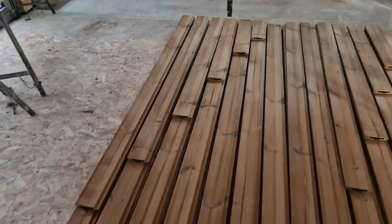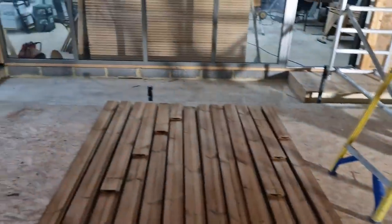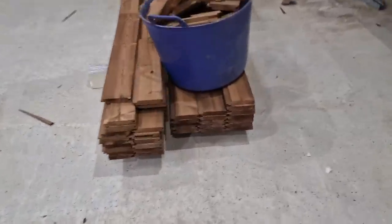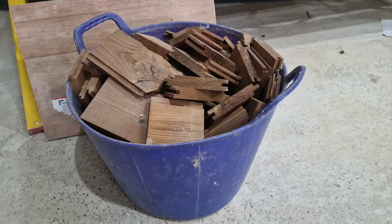I'll talk about the joints. Because we're using this Lamello, we're not creating any waste. The waste is very, very minimal. We're just trimming the ends up square and then using the cladding. We don't have to get a tape measure out once because we have the bench all set up. The bench enables us to literally just get the cladding from the pile, the ever diminishing pile, I might add, it's much, much smaller now, it's tiny. It goes from the pile onto the saw, cut the square ends, slide it all the way through, butts up against the end here, slide the next one in, cut it, and so on, and then you end up with a course. And with the offcut that you generate from that course, you start at the end with that one and so on and so forth. And that's how we get this limited amount of waste.